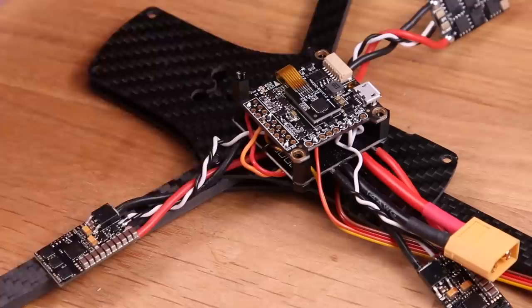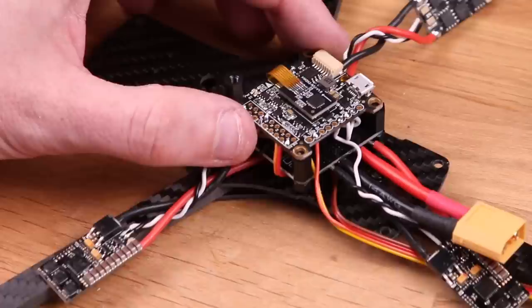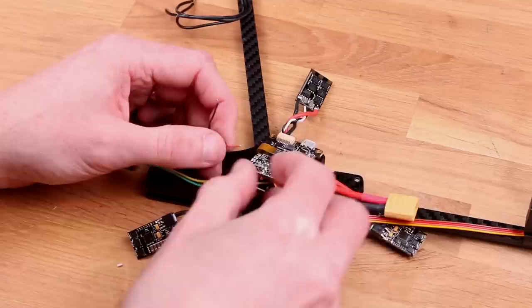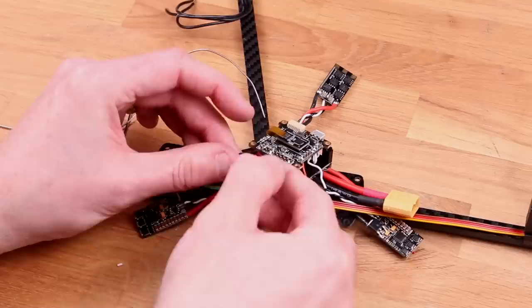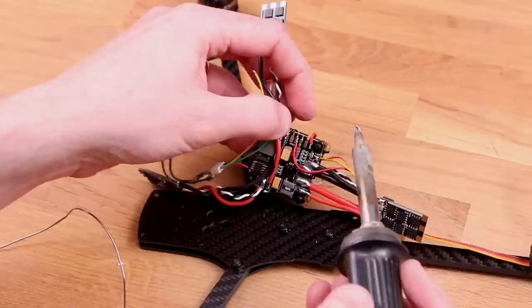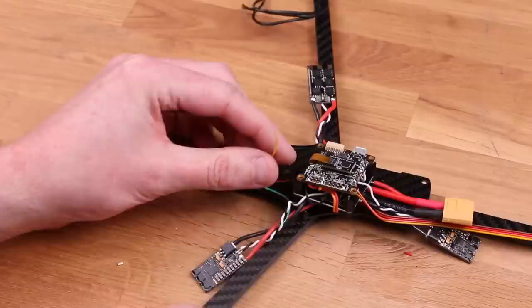If you're having that trouble, what you can do is add more fresh solder onto the old solder joint, and that's gonna make it flow out, but remove the heat pretty quickly then, and you should be left with a nice solder joint. If you're left with a little blob on there, that's because you didn't heat it for long enough or you had way too much solder on it. You can remove some of that by wiping off the solder tip and then just before you touch that blob, add a tiny bit of new solder to the tip and then you heat it and pull it away. And that way the solder always flows to the hottest point, so it wicks up on the tip and you can pull it away.